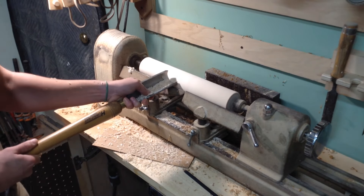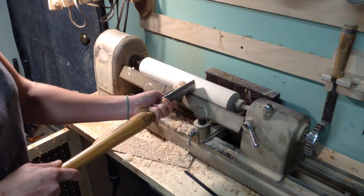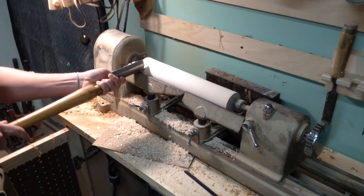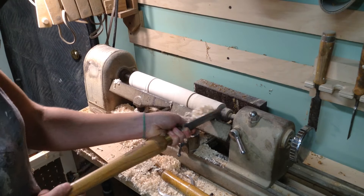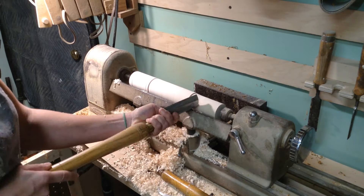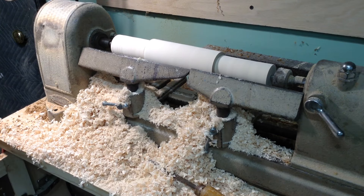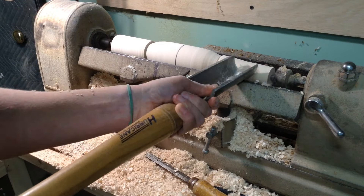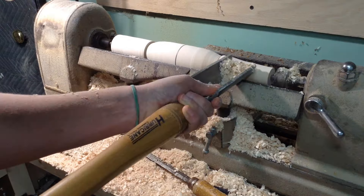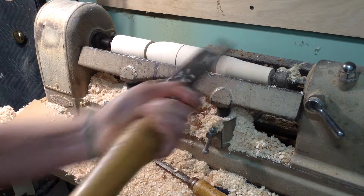I'm using big roughing gouges to rough out the shape and get the diameter I need to start with. You'll notice in this video I'm not really using the tools you should necessarily be using for this application. I'm using larger roughing tools — that's just because I'm a little lazy. Most of my tools are not sharp enough, so I stuck with the ones that were sharp. This was a quick turnaround job and I don't have my sharpener set up, so admittedly that is kind of how I got this done. I marked center on the piece and I'm basically using exactly what this tool is made for — roughing it out.